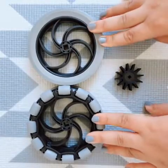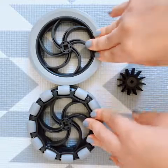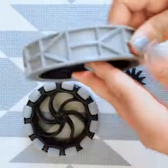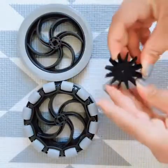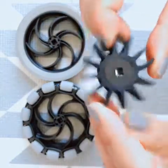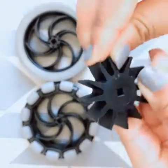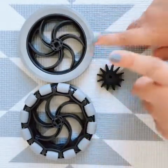Now, how the robot moves. There are many different types of wheels, and there are even more than what I'm showing here. The main ones are: this is an omni wheel, which has rollers on it, giving it the ability to move side to side with ease. This is a regular wheel, which has trouble moving side to side but has great traction. And this is an intake roller, which is a smaller wheel with flexible panels so that when dealing with any object being pulled into the robot, it can grab and intake it. That is the difference between omni wheels, regular wheels, and intake wheels.